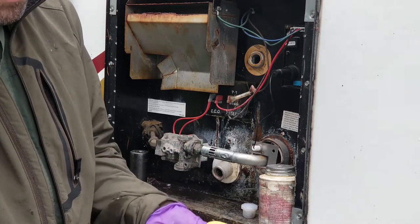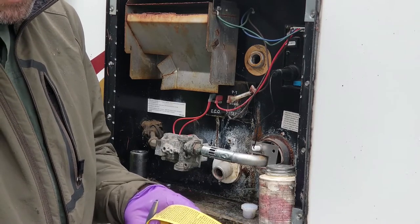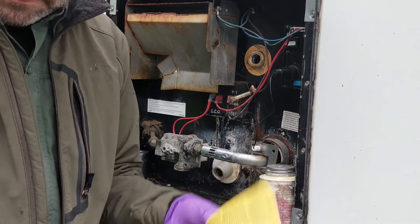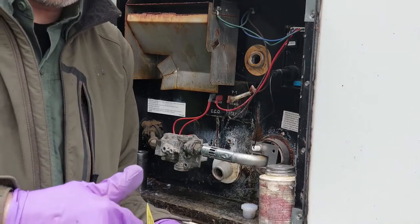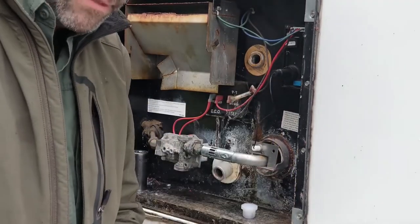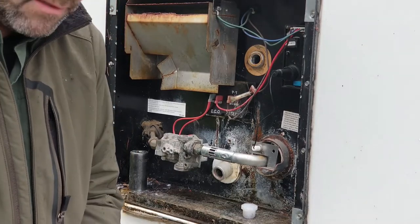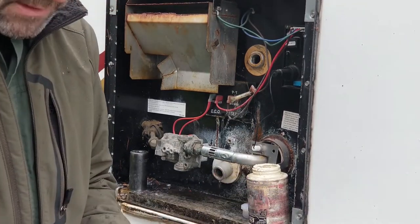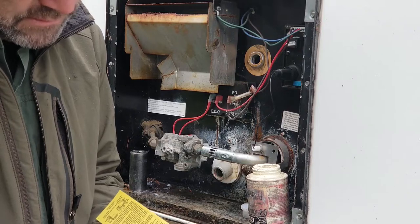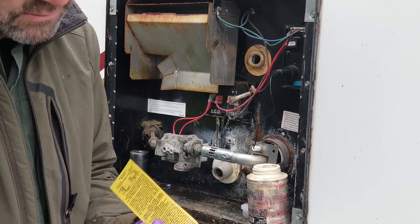So the specs are the same, 150, 210. So 150 PSI or 210 degrees. If it's weeping outside of those parameters, then it's failed. So, Teflon paste. You could use tape or paste. I just prefer paste. It doesn't make it bigger. Sometimes when you use the tape, it might make the threads a little bit bigger around. The paste kind of helps lubricate it as it screws in.